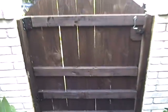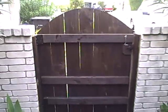And the main thing, you can't really attach it until it's glued real good using this liquid nails. Just use any heavy duty liquid nails. It took 2 tubes on this side, and 2 tubes on this side. And then I just used treated plywood to go across here, and just the cheapest brackets that I could find. And that's my little gate into my courtyard.